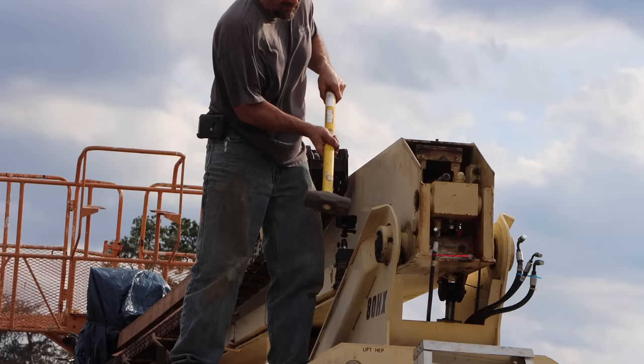I really don't think 20 tons is gonna do it. I would need a 50 ton press. What I'm getting at is I think that pin needs to go. My options are Sawzall and cut it there and cut it there. Then at that point I can just take the cylinder out, and then I'll have this little piece to deal with, this little piece to deal with. And with this on the ground, I can then take that out.